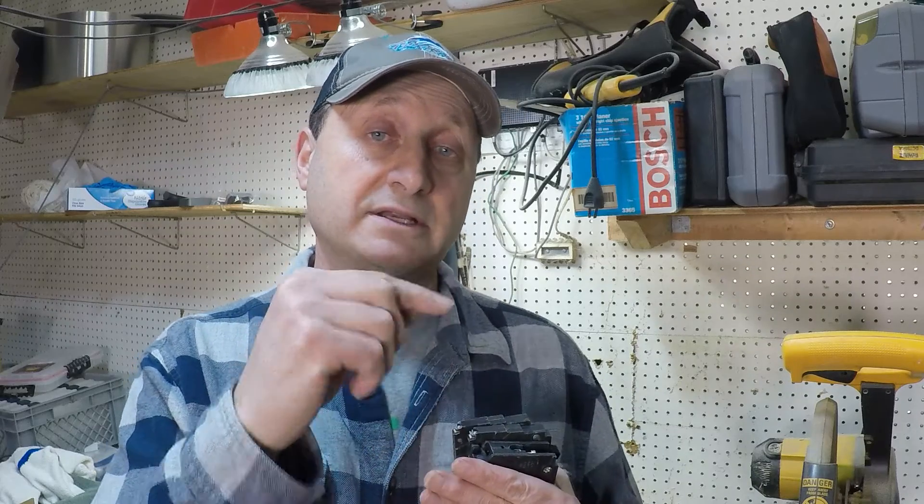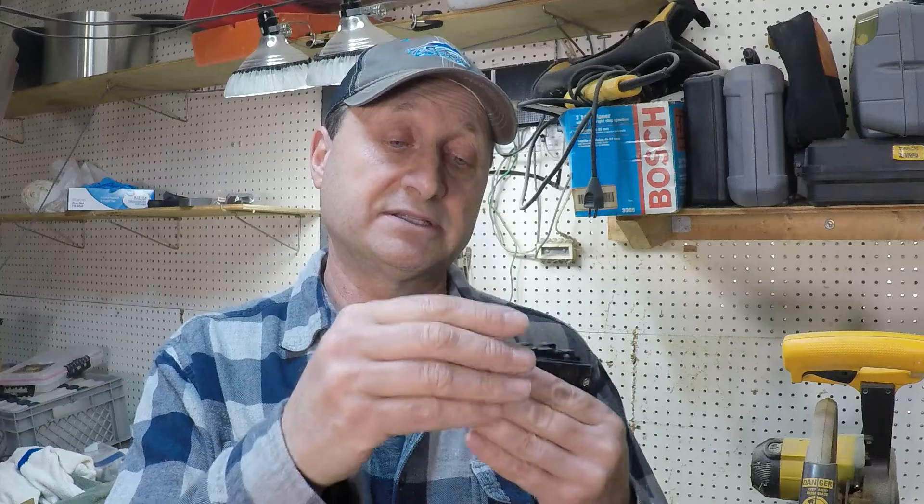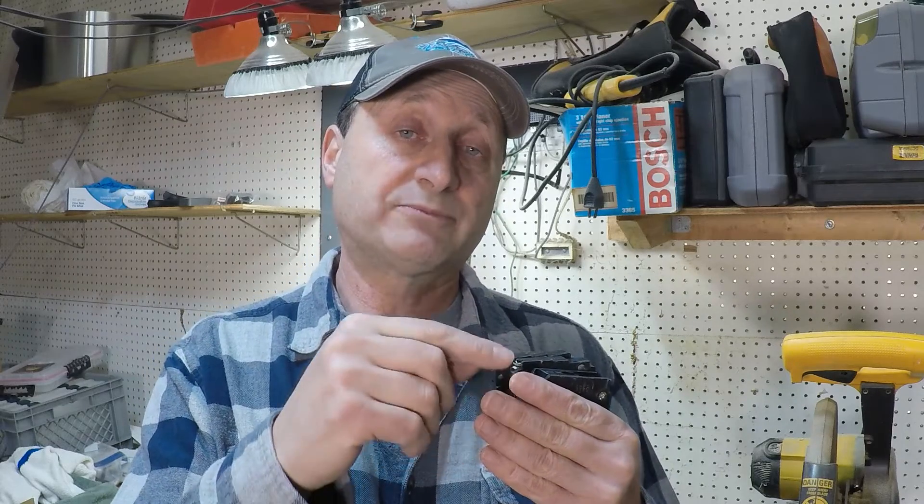You also have the ability to use a GFCI breaker for the line going to your bathroom, your kitchen outlets above the counters, or your microwave — instead of installing GFCI outlets in your home. If you do install a GFCI outlet, you want it to be the first thing the wire reaches when leaving your panel, because that outlet, when tripped, will protect everything downstream. Some people put it at the end, but then you're not protected upstream of that outlet.